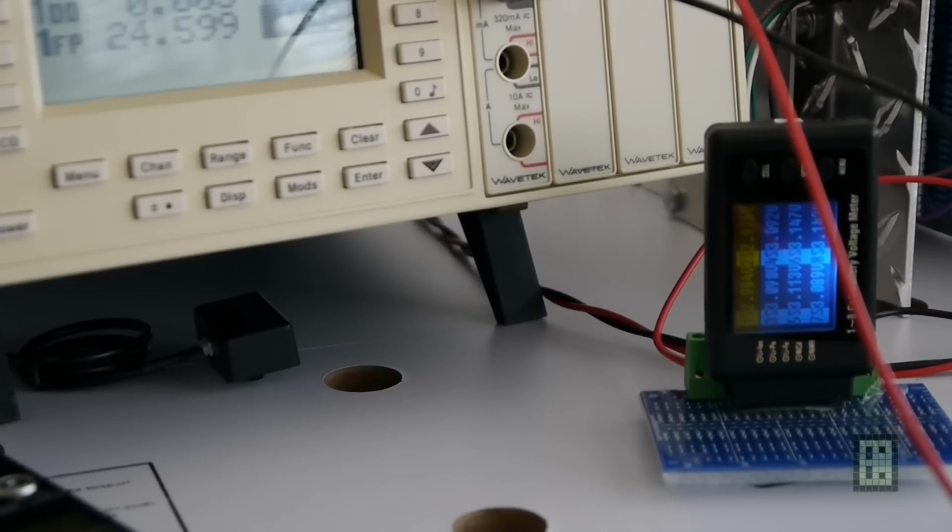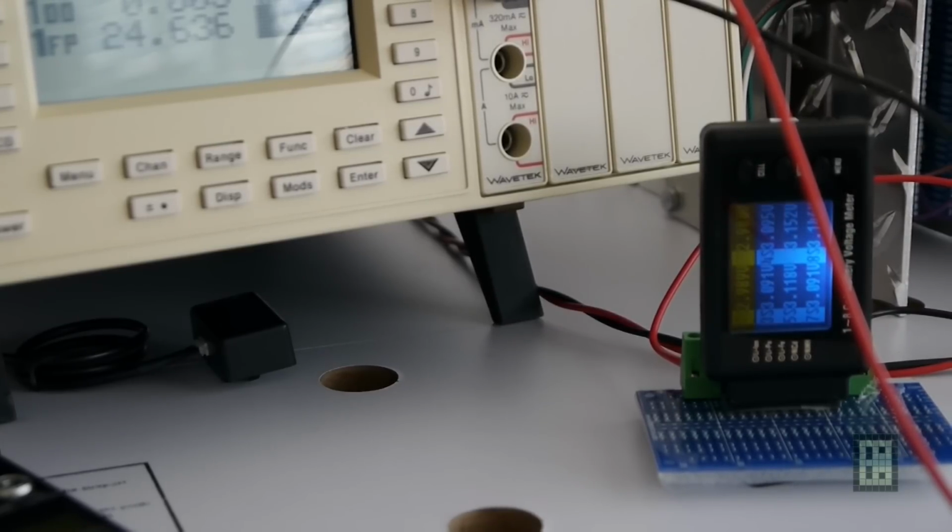This is maybe about 3 or 4 minutes after I stopped the test and disconnected the load, and as you can see, the voltage on 3 of the cells didn't recover above 3 volt. Actually, it's only 2 of the cells. I don't know why cell 6 is flashing, because I see it's over 3.1 volt. No idea, maybe, yeah, I think that one is the highest one. And it's flashing because the difference between the highest one and the lower two is higher than 100 millivolt. That was the maximum delta I allowed.